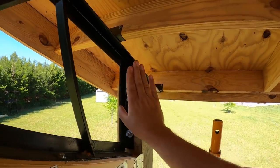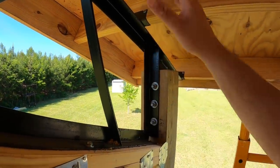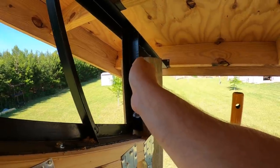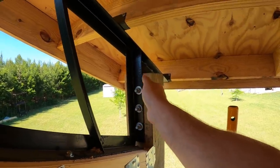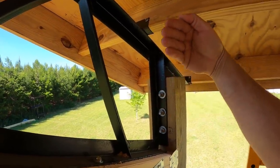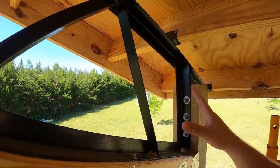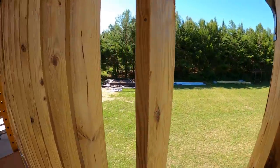So if I lay a piece of sheathing straight up and down on this wall like this, there's 8 foot. But what I'm going to do is lay horizontal, because everybody tells me there's a lot more strength laying horizontal. Well, it's 4 foot wide. So if I do 4 foot, 4 foot, there's 8 foot, 4 foot again, there's 12 foot. That's going to help me out with the blocking. Plus, it's really going to make this wall strong.